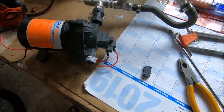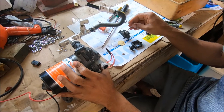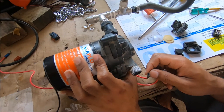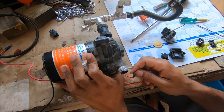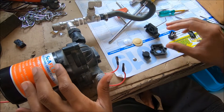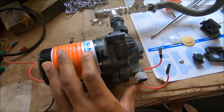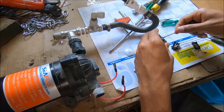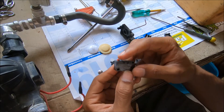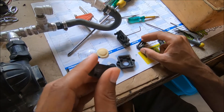For those who'd like to see how the pump switch was tested, keep watching. On this pump, the water pump was turning off once the water tap was open at constant flow — just shutting off and turning on repeatedly. We narrowed it down to a faulty switch. This pump is about a year and a half old, so we knew it wasn't the pump itself. After some diagnostics checks, it turned out to be the pressure switch, which runs a normal small micro switch similar to this one.